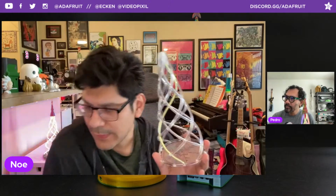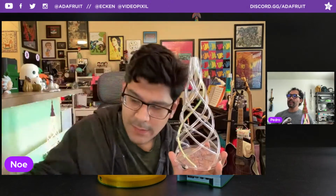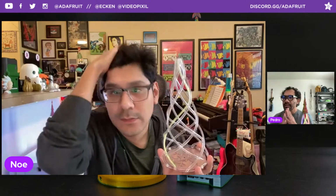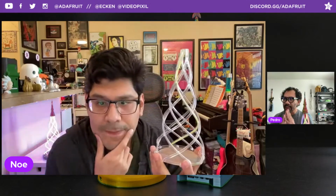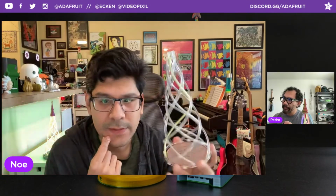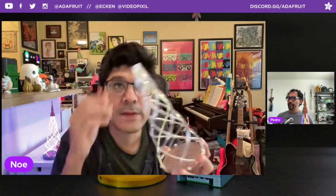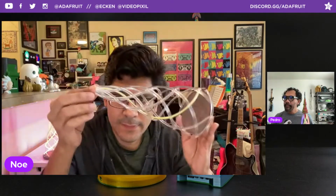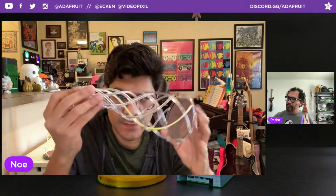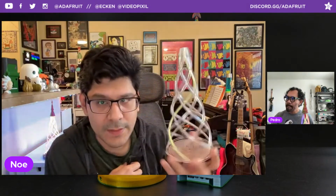You've seen us print other models like this D20, very clear. And some of the printed place models. It's not hard, it's almost like malleable. It is malleable, yeah. The thinner it is, the more malleable it is. So we 3D printed our snap fit cases as a test, and that seems to work out. So you can do snap fit geometry, the exact same geometry as for an FDM print.